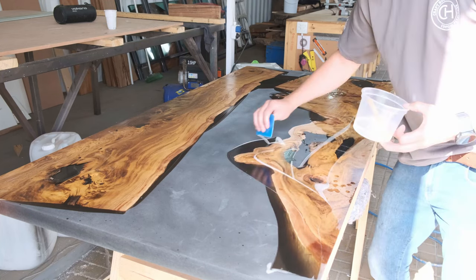Step nineteen: polishing. If you're not going for a smoky finish, you'll polish your table. We use the Festool system — three colors with three different polish pads: orange, blue, and white, in that order. Sand to 1500 grit, then work through the orange, blue, and white pads. We use a polishing machine on a very low RPM for this stage.